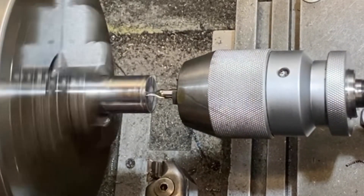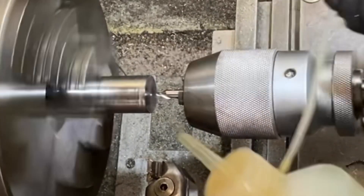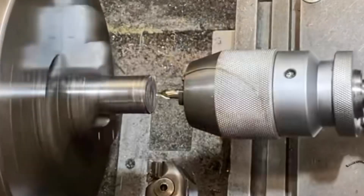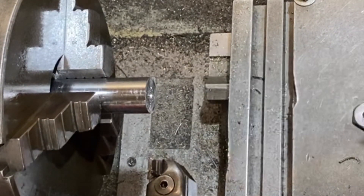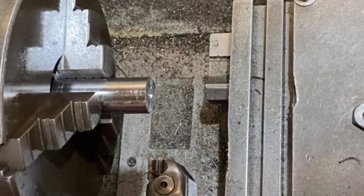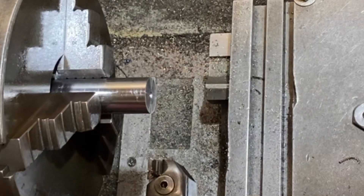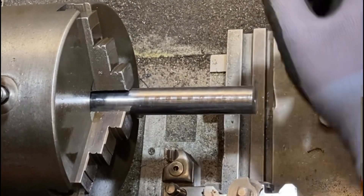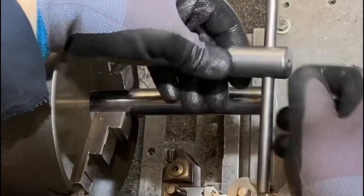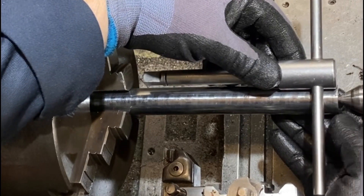Running about 1100 rpm for drilling. Make sure the centre drill stays clear and that there's plenty of lubricant. I'll move the tailstock out of the way, clean the end of the work, and change the chuck for a centre, then pull out the stock and set it up with the centre in the end so we can start machining the outside diameter. How much do we need out? Well, let's just use the chuck key we're copying - yeah, that's probably perfect.